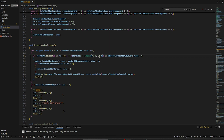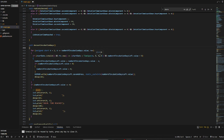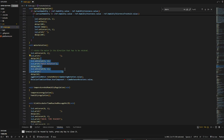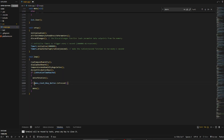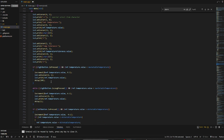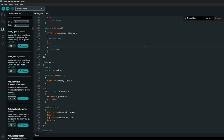The next part is the decount of incubation days. We are decounting the number of incubation days - if the start date is valid and the current time equals the start date plus a time span of N seconds. This time span represents a shift in time: this part represents seconds, minutes, hours, and days respectively. As you saw in the Proteus design, the number of days was reducing every second, but to change it to actual days you put zero for seconds/minutes/hours and replace N at the days level. Next is the rotation check: if the rotation time has been reached, we rotate the motor. Finally, if the menu/OK button is pressed, we enter the menu where you can increase or decrease set points.